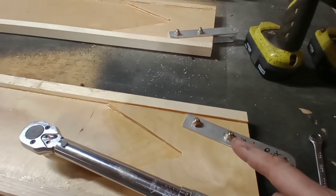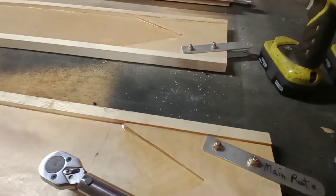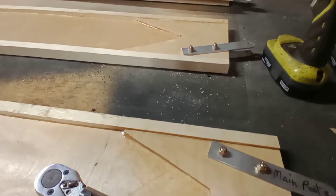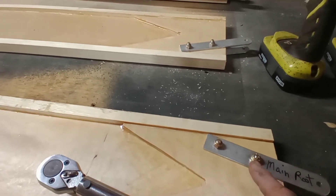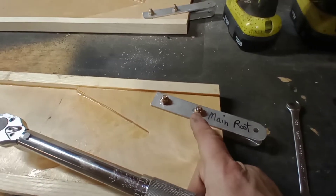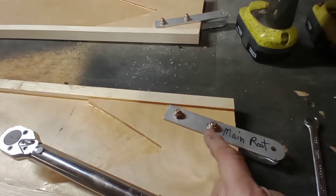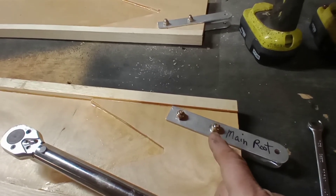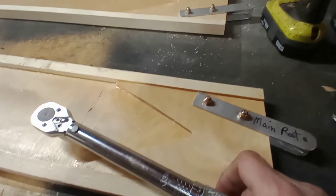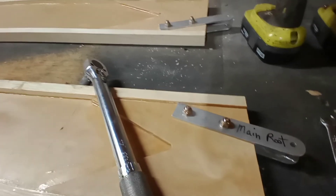I just go to the top end of the torque value to overcome the locking nut, because it's seldom more than a couple of inch-pounds. With AN3 bolts it's about one to two inch-pounds, maybe three. With 1/4-20 it's never more than five inch-pounds, and your range is 20 inch-pounds, so you might as well go to the top end — you know you're not over-torquing, yet you have full torque. The locking device only takes up about five inch-pounds.